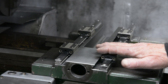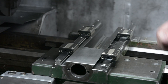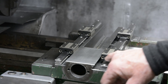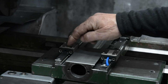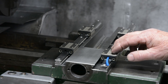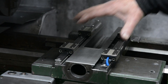The next part of the job — we're getting close to the end now — is to bolt the cross slide on top of these four trucks, but after we've fitted the ball screw and the oiling pipes on all four of these, which will be brought out to the ends of the cross slide for easy access. When that's all done I'll be ready to go through the alignment of the cross slide.